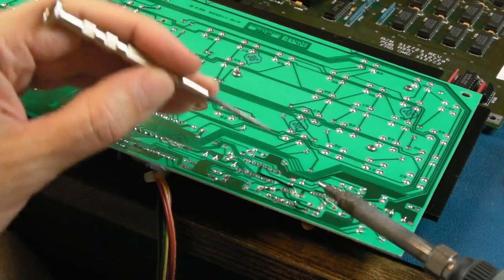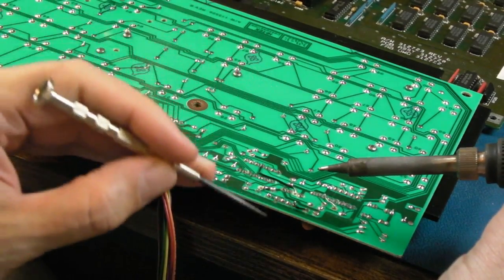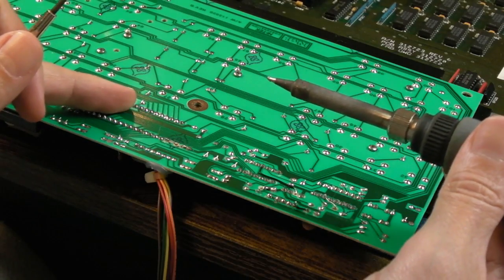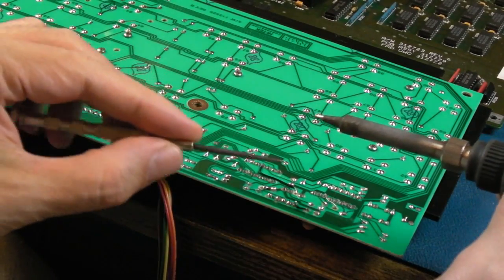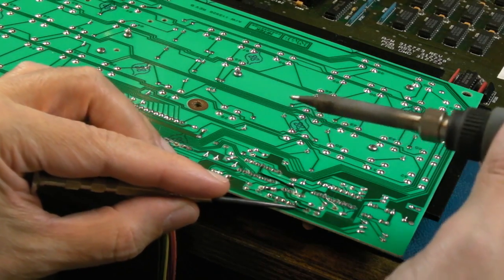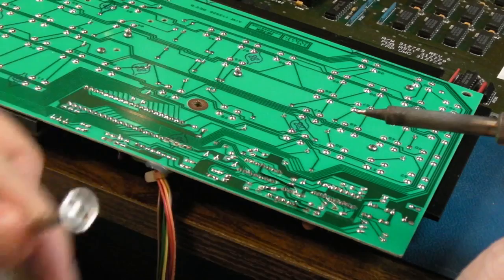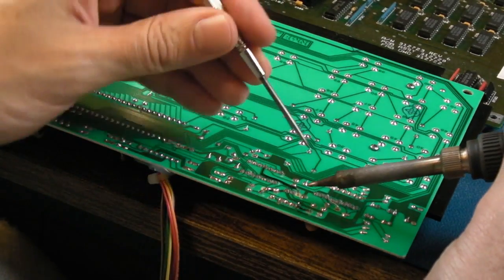And the super annoying thing with this is it's where these 2 damaged wires are, look. Both on the 555. I suspect that what happened was the chip maybe had an issue. At some point he swapped some caps and things, recapped it, and lost to ground, and then when it's lost to ground it's gone, oh my god, what's wrong, start to swap everything, and created some more damage here around the 555.